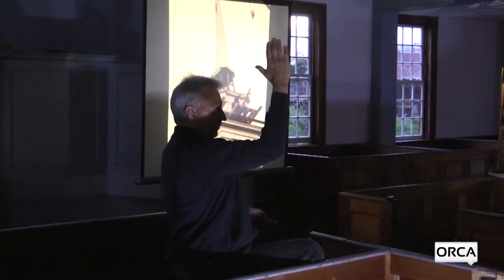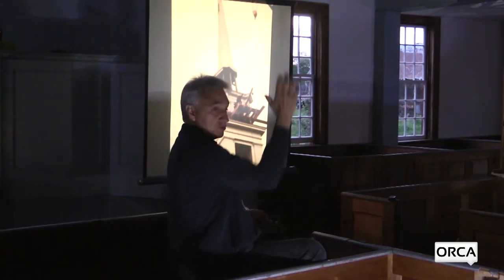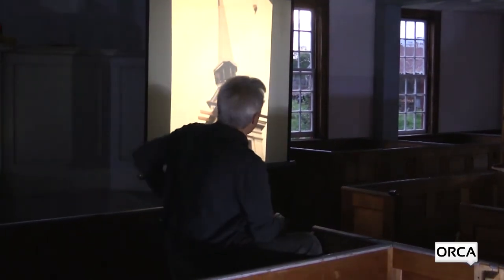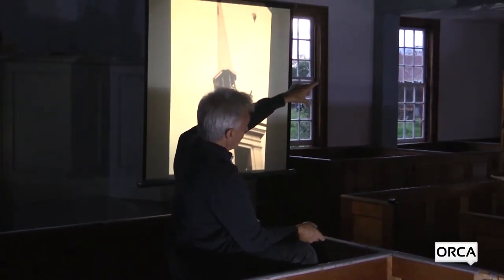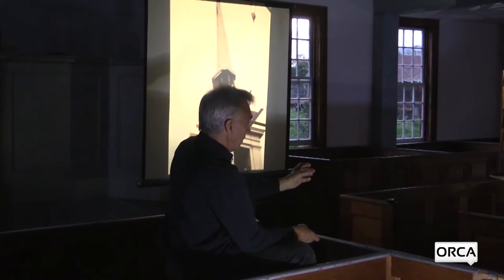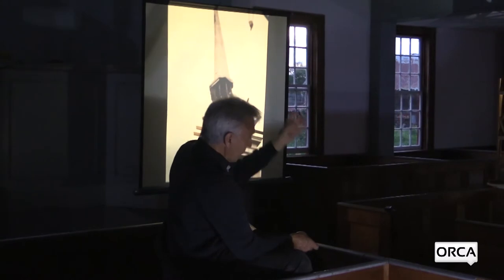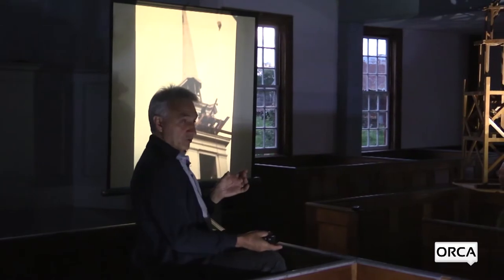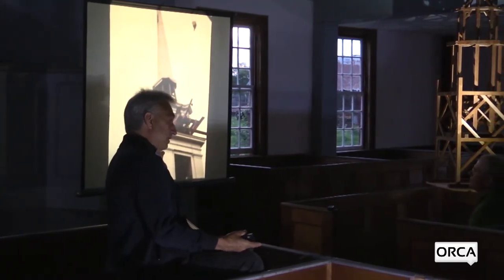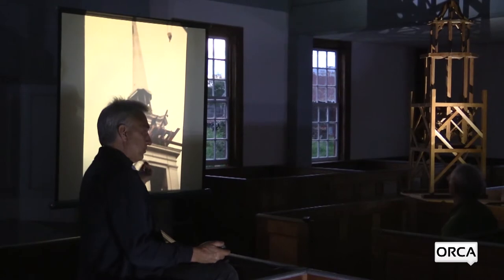It was meant so that if things blow a bit, the mast swings a bit and retains the center of gravity correctly. The problem is, whenever you penetrate the top of a wooden object with a large metal object like a weather vane, in this case a 2.25 by 2.25 iron shaft 11 feet long, no matter how well you flash it, you're going to introduce moisture over time, because nobody ever goes up there. And even if they did, you condense moisture on it from temperature change. So eventually, that was another case where one day the weather vane was laying in the driveway.